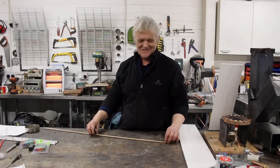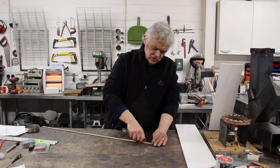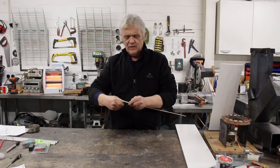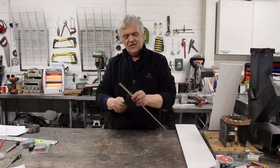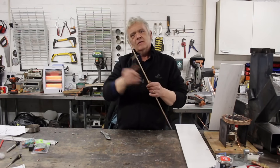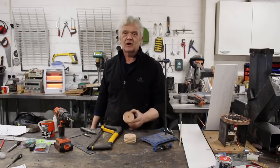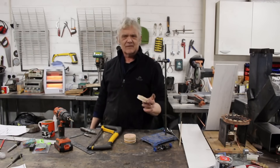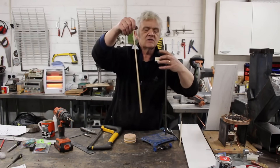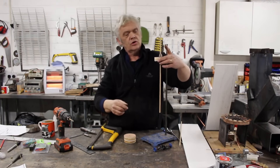It's a bit of 8mm dowel. If you start doing it the wrong way, you're going to be sorry. What you need to do with the knife is hold it and keep on scoring it until it starts to go through — clearly working away from your hand. Once you're starting to get it through, you'll be able to wiggle that knife blade in there. Then we can take it out and insert our knife blade — that will be the point of the bearing. Then we need a bit of a bob, a counterweight, and something for this to swing on. I've got three discs of wood that I cut out ages ago. I've drilled a slightly larger hole and put a saw cut straight across the centre, and I'm going to put it on the stand like that. Here's my pendulum with its rod — we pop that down, rest the knife blade in those saw cuts so it won't move.